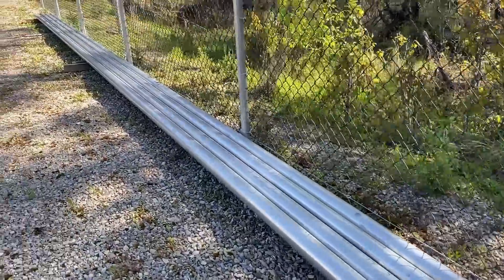As I mentioned earlier, this vertical is part of my 3-element, parasitic, 12-direction, 160-meter array. Please check out my video explaining that if you're interested — I'll put a link for that video below. These irrigation tubing verticals are a great option for 160-meter radiators. I think they're way more affordable and easier to install than using tower sections. For 80 meters, it'd be really easy to install a few of these for a transmitter array. Hey 73, this is Steve, V6WZ.